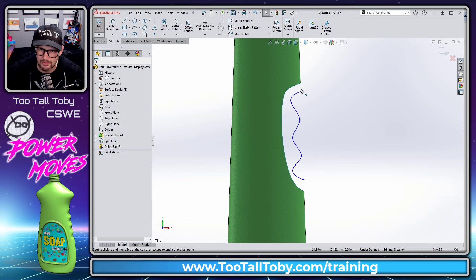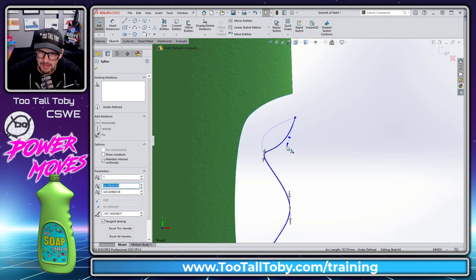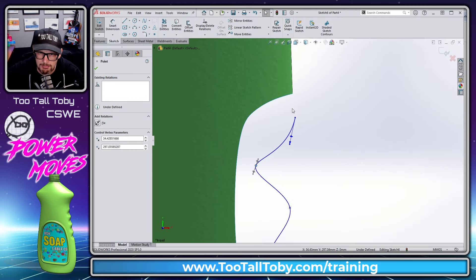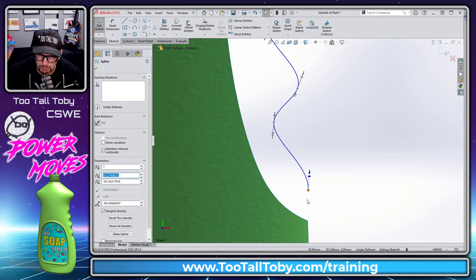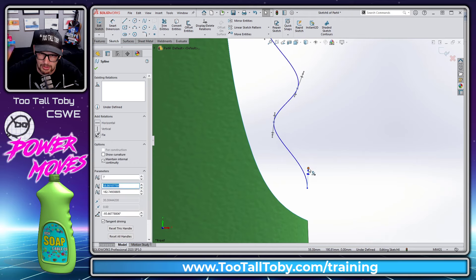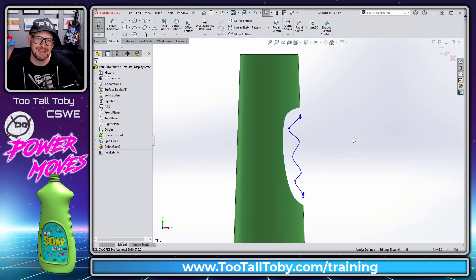Create a spline that looks a little something like this for the grips. Click on the spline, use the manipulator handle to adjust the shape. What you want is a smooth transition — we're going to be coming off tangent from that edge. Do the same on the other side: take this spline point, move it a little, adjust the manipulator handle so you have a nice smooth transition coming off the edge into your spline point. That's going to help when you create the fill surface with the constraint curve.